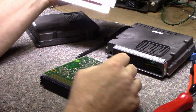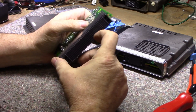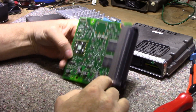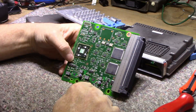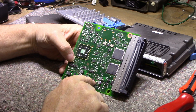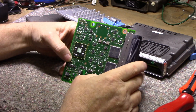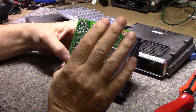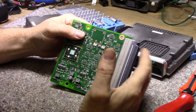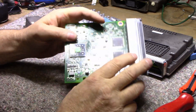So that's how they draw heat out the bottom. They had a heat sink on top for the processor, plus a quite wide connector for data and control. We've got what looks like four power supplies and four inductors — one, two, three, four. One chip looks like it controls two of them and the other chip controls the other two, so they're producing four different voltages for the processor interface. This monitors the health data from the processors — temperature, loads — and compiles it and sends it back to the FSP host.